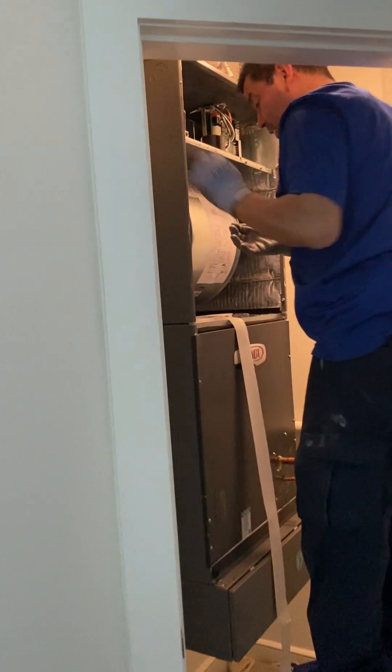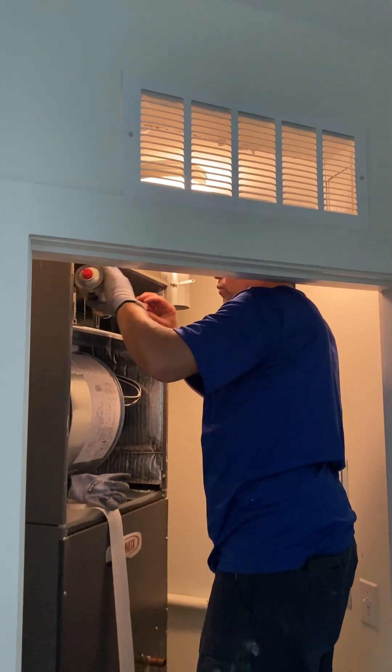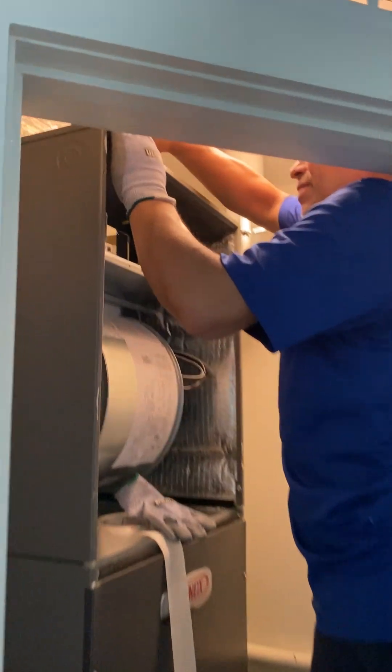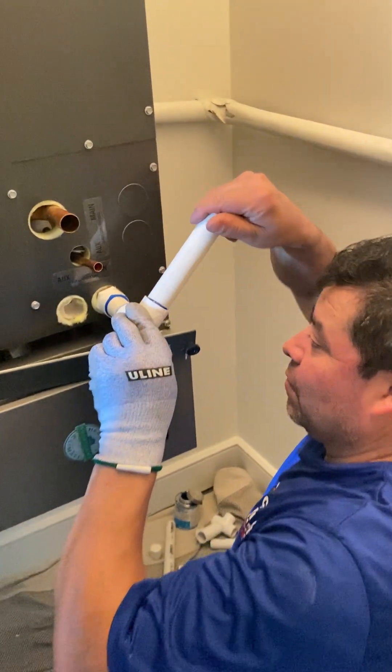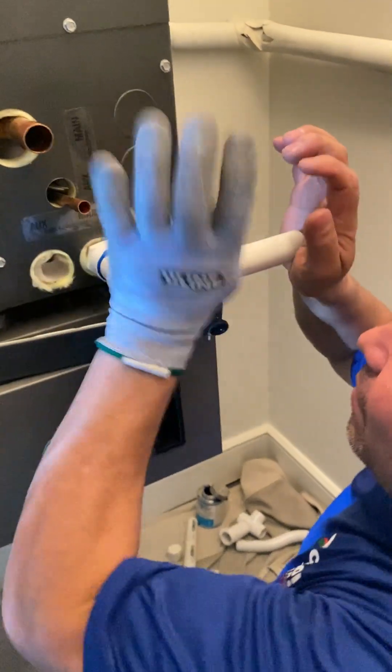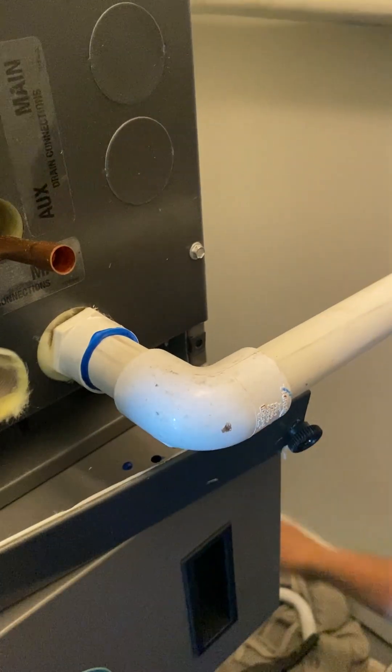They managed to hang this thing beautifully — he's busy taping it up. The five-inch filter is at the bottom, so air comes in at the bottom, moves under this door, and through that return vent. It's a small apartment so there's plenty of return airflow. We raised it so there's a little storage space underneath. Elia is busy doing the condensate drain line, doing it nicely.